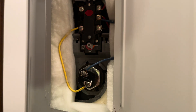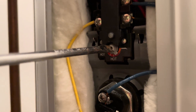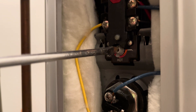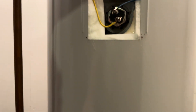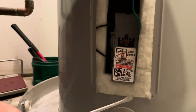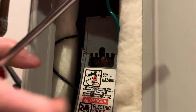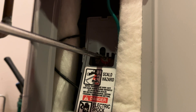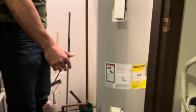For adjusting the temperature, there's this little gauge here — we're going to adjust this one up a little bit. We had a resident ask us to turn up their hot water heater, so I'm going to turn it up to about there, and we're going to adjust the bottom thermostat the same way. You want to be sure to adjust both of them, because if you only adjust one you'll only be using one element.